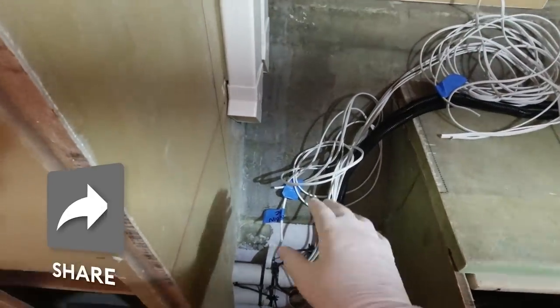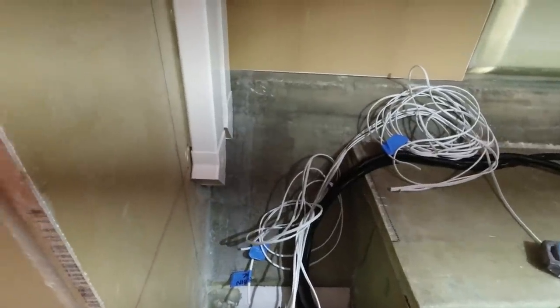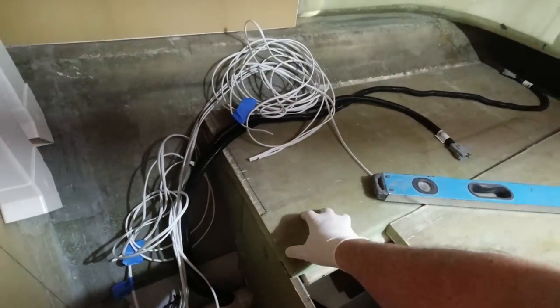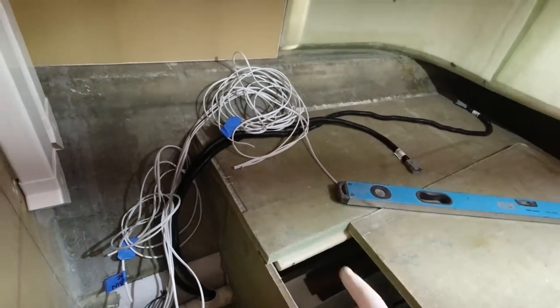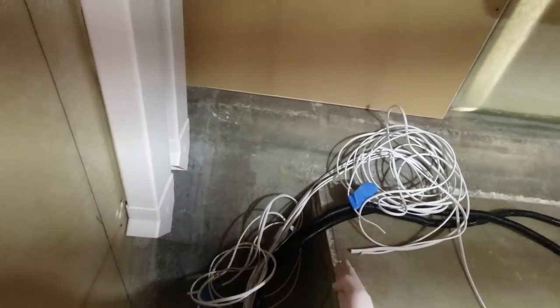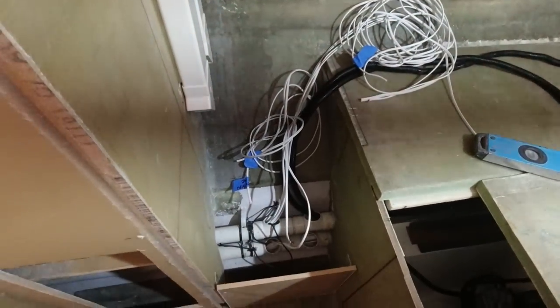Little kids or adults shoving bags in there where we've got potentially very important wiring — this is where the whole helm station comes down through these conduits here. I'm going to get this compartment in, and obviously that means I need to get the bed locked down. Underneath there all has to be tabbed, flow coated, and locked down, and then the other panel is going to sit on top of that and be glassed to the bed itself. So there's a lot to happen here.